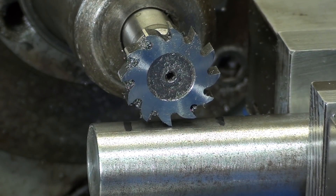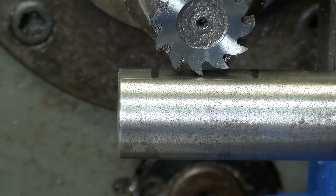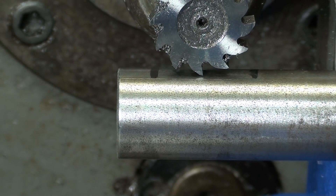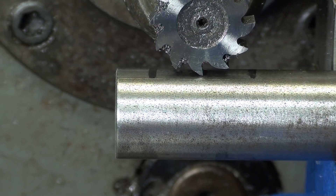I'll add a little bit more to it. Can I talk just a little bit about safety? Make sure that you have your safety glasses on. Get everything clear away from the spindle. Concentrate on what you're doing. Think of the dangers involved, and let's get to work. You need to locate exactly on the shaft where you want that key seat to be, so I put two little black marks there — that's about where I want to be. So I'll find about the center of that and lock the table in the X-axis. The table's locked in two directions, and I'm going to feed up.